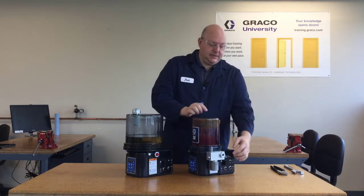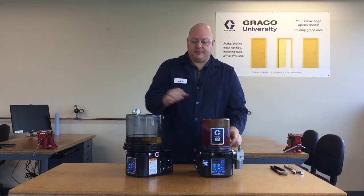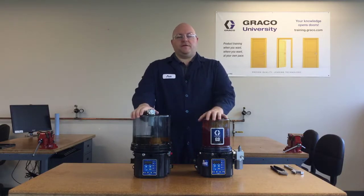On this system, the pump element is hidden behind a vent valve. So before we change the pump element, we would need to remove the vent valve. Every pump is going to have some kind of arrangement of a relief valve and fittings which are going to need to be removed first.